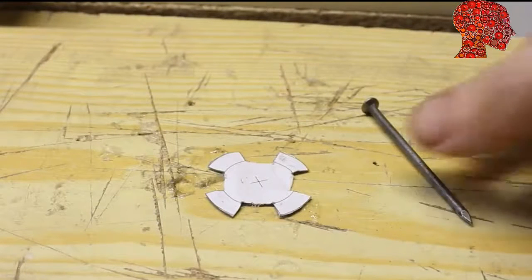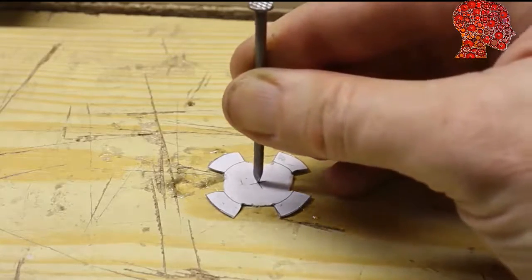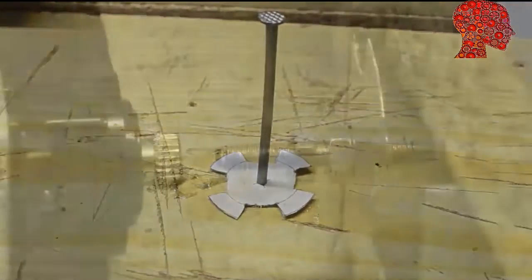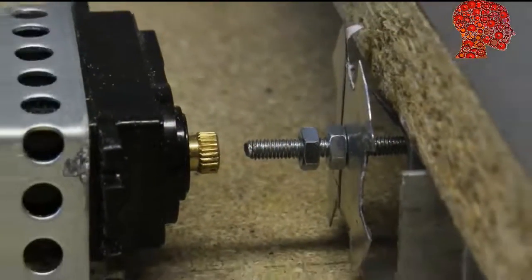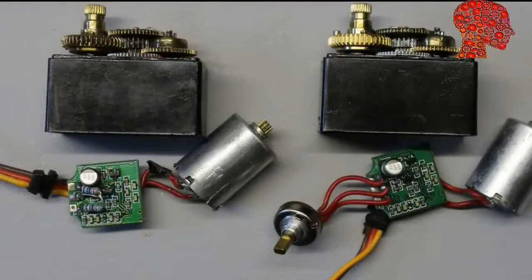The sensor disc for the rotary encoder is cut from a tin can. That's what all scissors or metal shears are good for, the center hole is made without a drill. The axes are driven by standard servos having metal gears and ball bearings. 2 of the servos have to be modified for continuous rotation. First, the stopper on the gear at the output shaft has to be ground. After that, the potentiometer has to be removed and replaced by a voltage divider composed of 2 constant resistors.